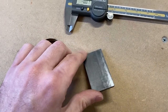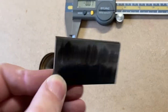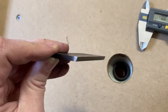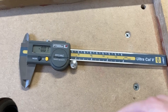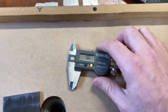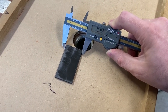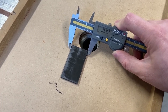We got one of the vanes out and we'll take all of them out to verify condition and make sure there are no big chips. This first one looks pretty good — I don't see any big chips taken out of the edge at all. We've got our Fowler calipers here, not the cheap Harbor Freight junk — Swiss quality. Let's see... we're getting about 35 millimeters. I don't know what the standard length is, but that looks like another couple of years out of it.